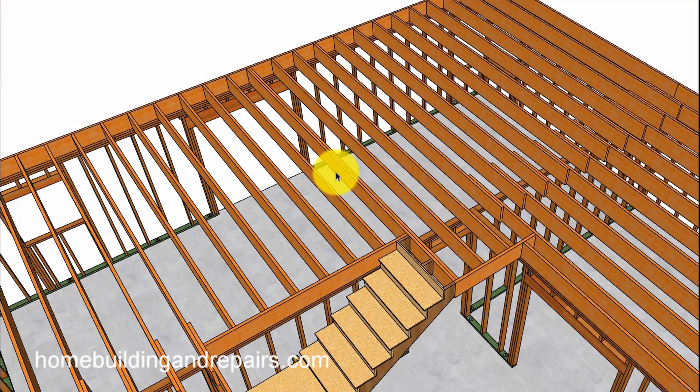In this example we are using the floor joists — they're cantilevering out to support the stairway and the edge of the floor. This can also be used in the opposite direction. If the joists are running at 90 degrees, running parallel to the stair stringer, then the cantilever could stick out past that wall. That would all depend on the framing and the design.